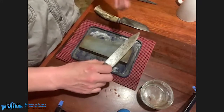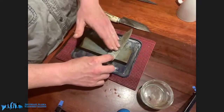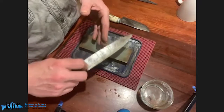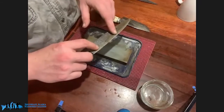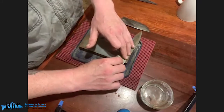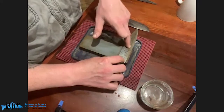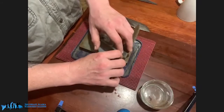When I'm in person and I'm showing somebody how to sharpen a knife, what I explain to them is think about the motion that dulled your knife, right? You were cutting. So you were slicing through something, and eventually that dulls your knife. So what we're going to do is the opposite of that. Basically, we are going to slowly draw the knife over your whetstone, and we're going to push or pull the metal from the upper part of your knife towards this way. And you'll eventually get a burr, which is like a thin metal wire.